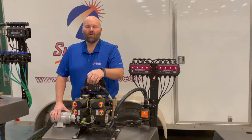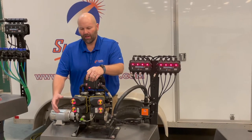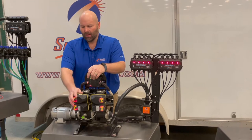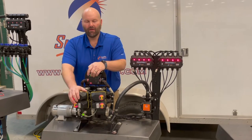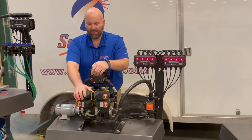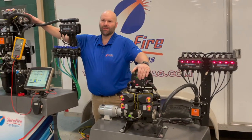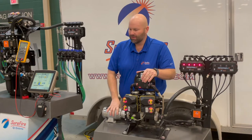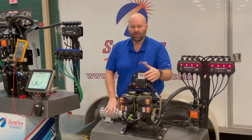Once your strainers are checked and you're getting ready to run, get in the cab and go into your original Green Star display or John Deere Controller 2000. Go to the section test and verify that all your section valves move before running the system. Here is a Gen 2 liquid shift valve stack and some regular section valves on the tower system. Go into the display section test, check the boxes, and make sure everything's working okay.